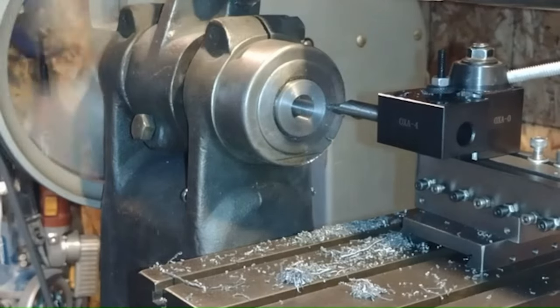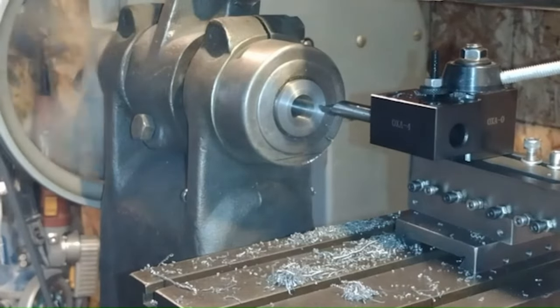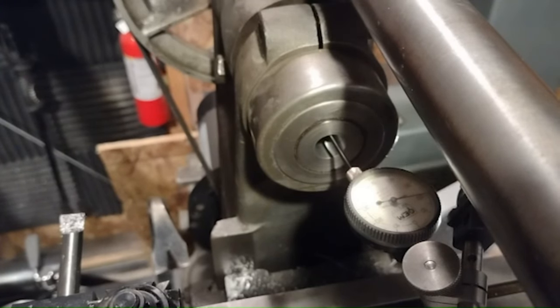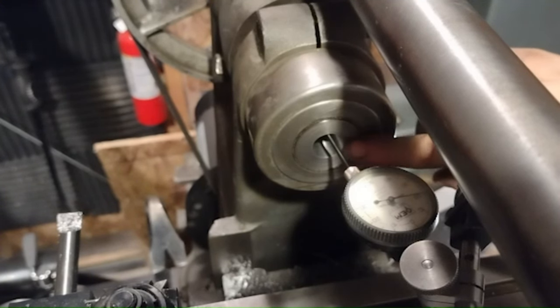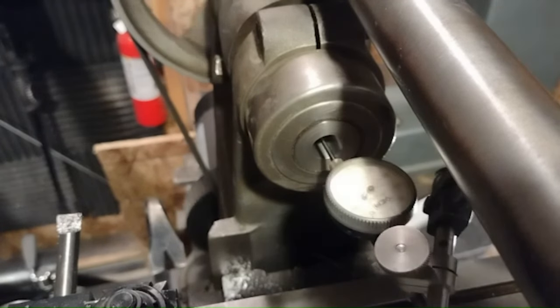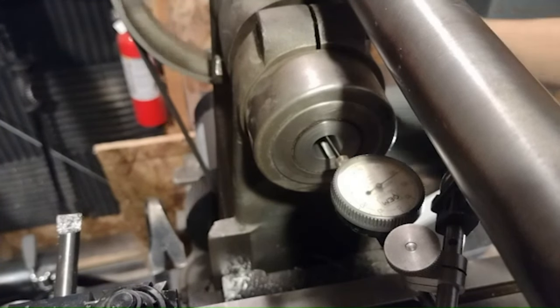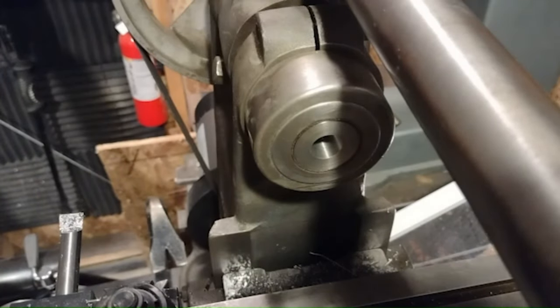What's this guy doing? Well, I'll tell you, deep-voiced viewer — the short answer is, I messed up. Definitely wasn't ideal. The taper got way too wide, so I had to face off a bunch of material to where it's flush. But as you can see, it's really concentric. And if you measure further in — very concentric, for sure. At least there's a usable tool now that'll be accurate somewhat.